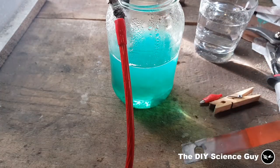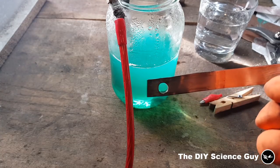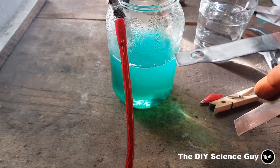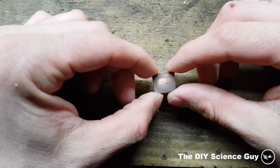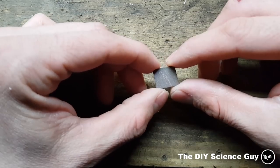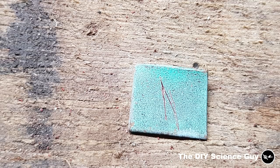The black edges on the copper I assumed were a result of the copper being too long exposed to the acetate solution, causing the acetate to create an oxide layer on the copper. So I put a small piece of copper in the nickel acetate solution without any current running through it just to see what happened. After about a week the copper had a crystalline layer deposited on it — probably copper oxide — and after a few days it turned completely green, which indicates copper carbonate from the CO2 absorbed from the air.